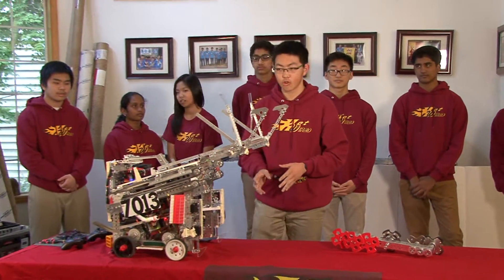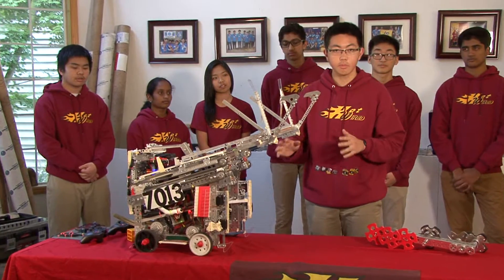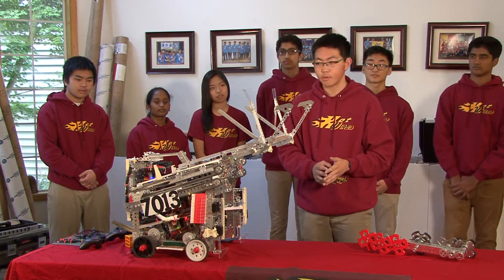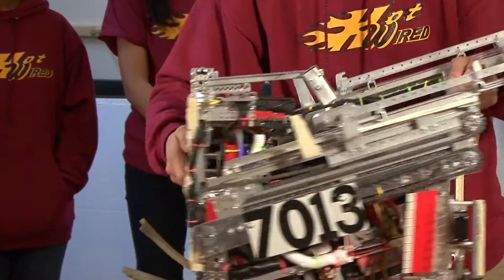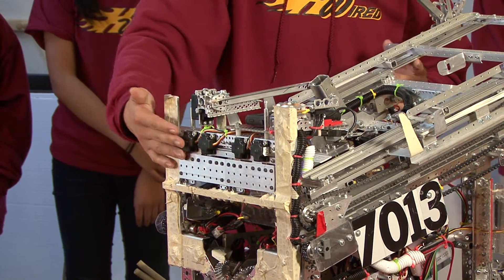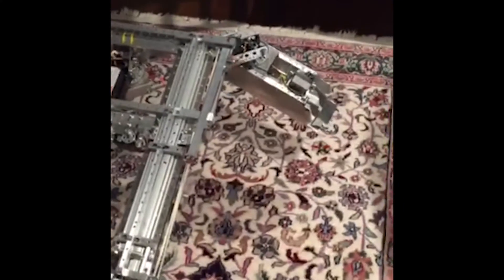This year's control was essential to our robot. In Autonomous, we used multiple different sensors, including encoders on all of our drive motors for effective movement, as well as a gyro sensor for effective turning and scoring the climbers. In addition, we have four different color sensors on the back of our robot for detecting the beacon.